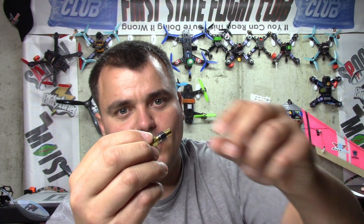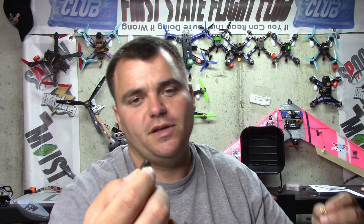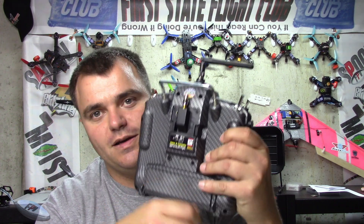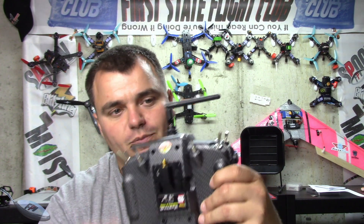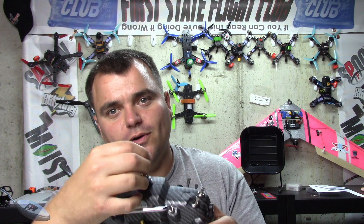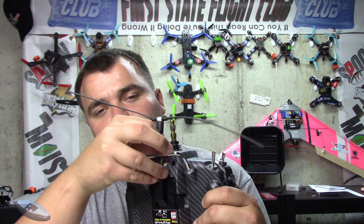So this is my standard loadout. I have an SMA connector, which has the pin on the inside, and then I have an SMA to RP-SMA adapter that I keep. This is the SMA one. I'll put it on there, and when I'm using the module with this antenna screwed on, sometimes I'll pull this antenna off. If you put it in a case and the antenna won't fit, you want to have a terminator on the top of there as well. So you'll need the adapter for it — put it on, and then you have a terminated style when you're using your external antenna.